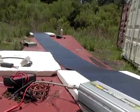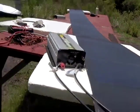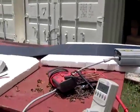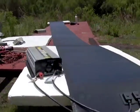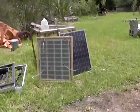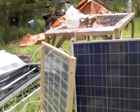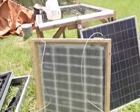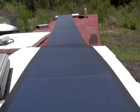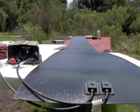Right now there's a little bit of haze over, but I've gotten a maximum through a grid tie inverter out of this panel of 111 watts, which is really good considering it's rated at 124 watts. Most solar panels — this 80-watt panel over there — generally gives you about 65 watts through a grid tie inverter. The one I made myself is a 65-watt panel, maybe close to 50, but this one comes really close to its rating, which means when they did the power rating they went on the lower end of actual power output, which is a good thing.